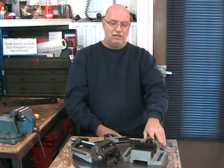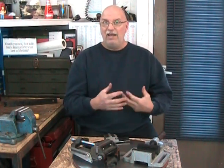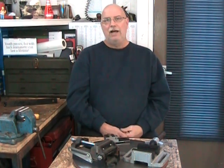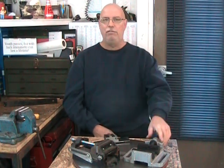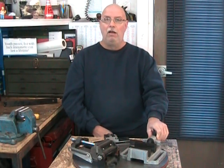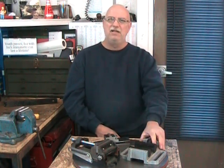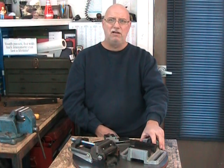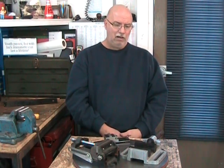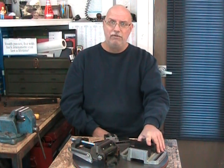The first reason is that this vise slides around on the work table. Grey cast iron contains a lot of free carbon — excessive carbon amounts — and that acts as a natural lubricant, helping the vise slide around on the drill press table with minimum damage. We also want it in cast iron because these vises have to be cheap. They're abused, and oftentimes they end up falling on the ground due to the manipulation involved in using them. Obviously they break, so we don't want to pay a lot of money for them.